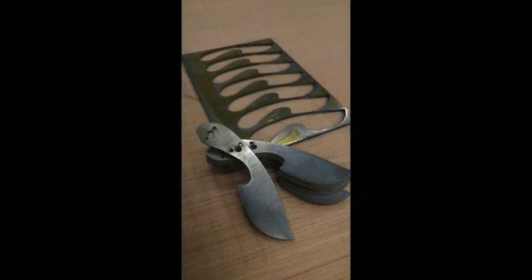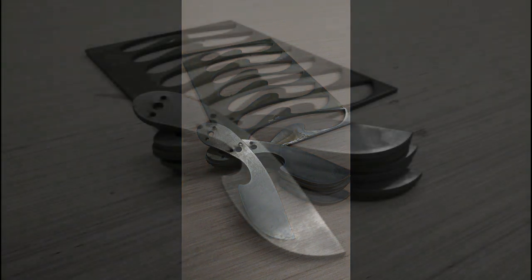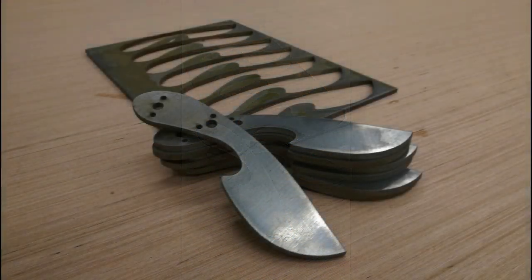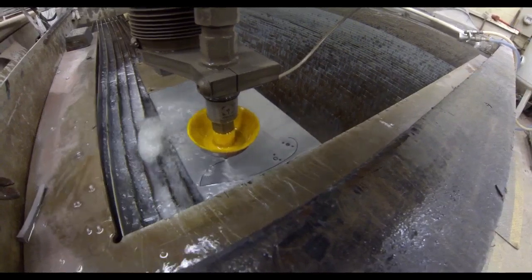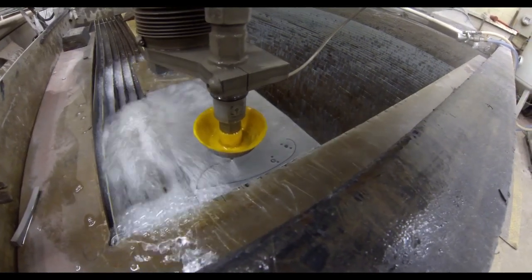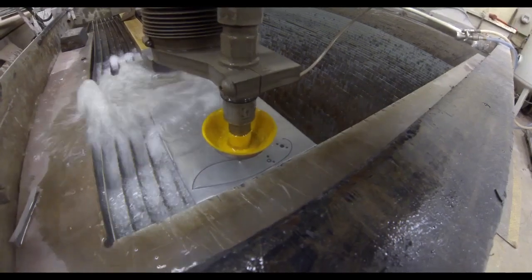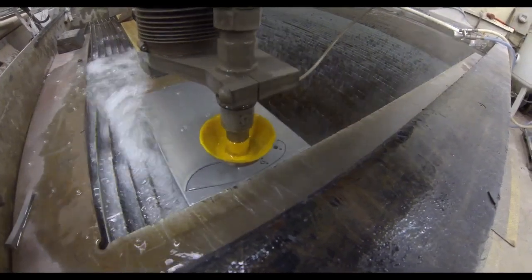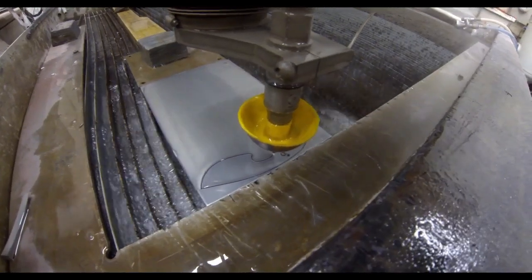The blank I chose is a small skinner. I've got these in stock. I had a company locally — Long Island WaterJet out in Bohemia, Long Island, New York — cut these for me. They're cut out of 1095 high-carbon steel. The WaterJet cut out the blanks very, very quickly. All of the blanks are the same outside shape and size, and they're all 3/16ths thick, so it's a good, meaty blade.